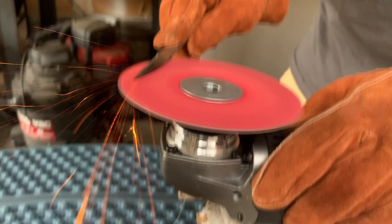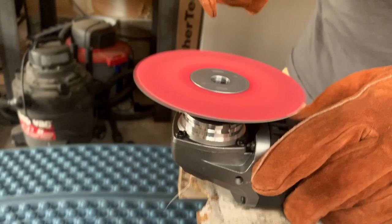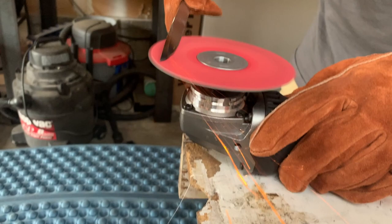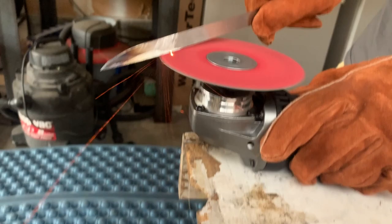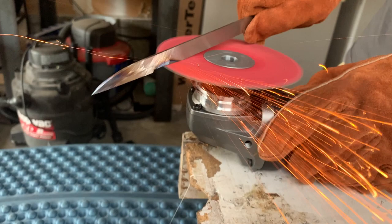When you go up to higher grits, they won't melt the steel away like lower grits do, and you can rest on that bevel and polish it up. Just a tip on shaping the tip — you don't want to sharpen the steel right now. The super thin metal isn't going to heat-treat properly, so you'll want to grind it off after heat treatment. When it gets super thin and has a burr, it acts as a radiator in reverse — it'll warp and heat up real quick.